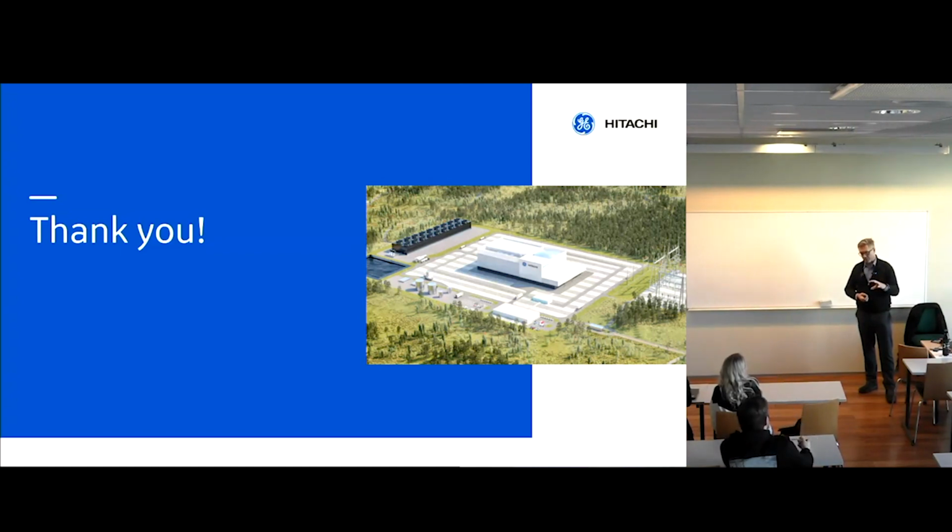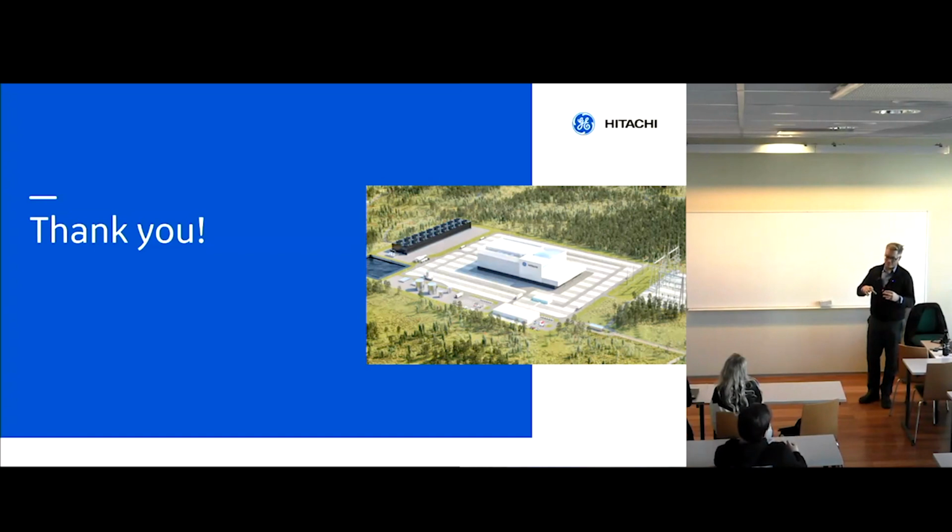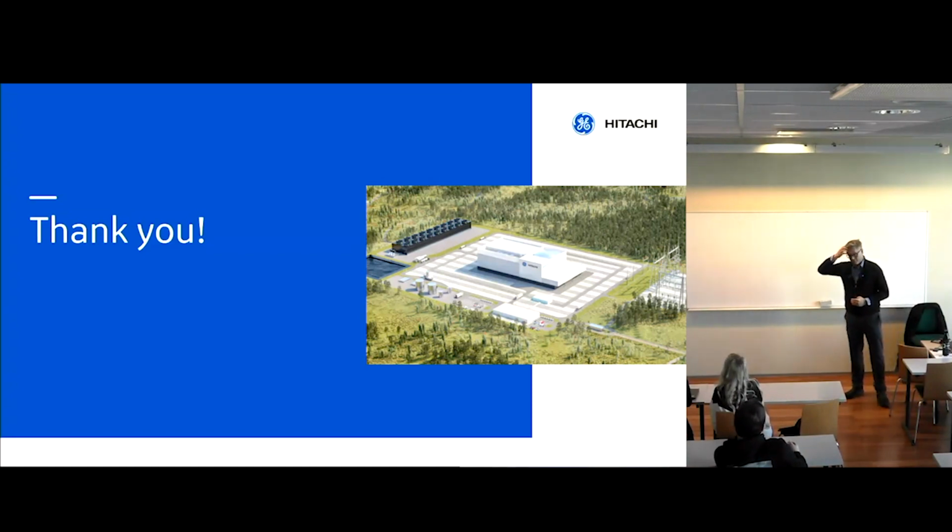Well, it's a little bit subcooled going into the core, but we're keeping the reactor vessel at saturated conditions, which is a straight line on your TS diagram. You basically have the same temperature whether you're liquid or steam. It's just where on that straight line you are. So the temperature is not different in the reactor vessel. It's actually very stable, maybe 10, 15 degrees subcooled at the bottom, but other than that, the whole vessel sees the same temperature because you're saturated.